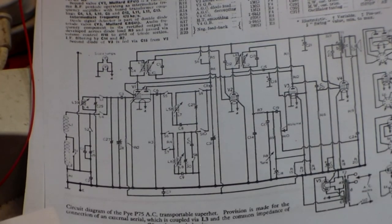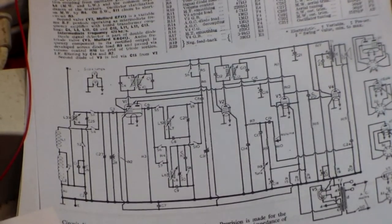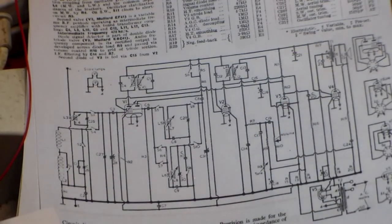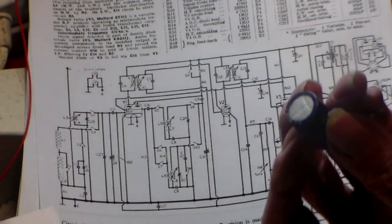Capacitors themselves, by the way, are easy to get, although new ones are often, in many cases, smaller than the ones that came out. So look for that as well. Also, the capacitor across the input in some cases. This is an X capacitor, something like that, out of old power supplies. Electrolytics go around one way. See, here's an electrolytic. There we are.